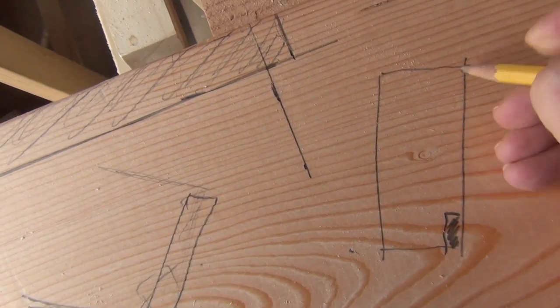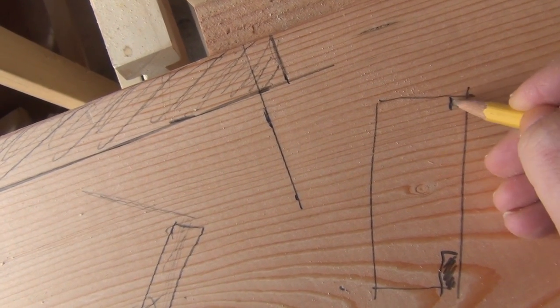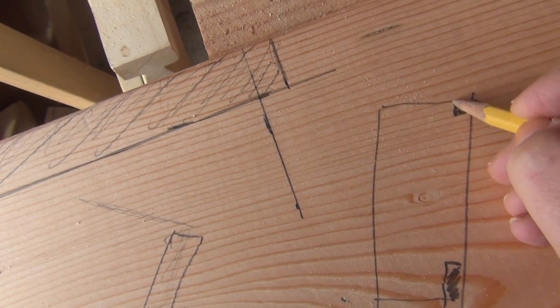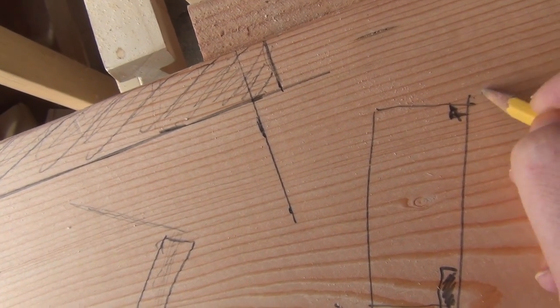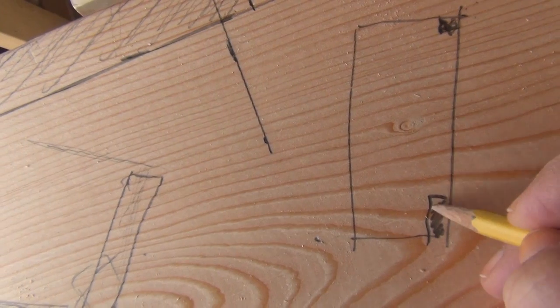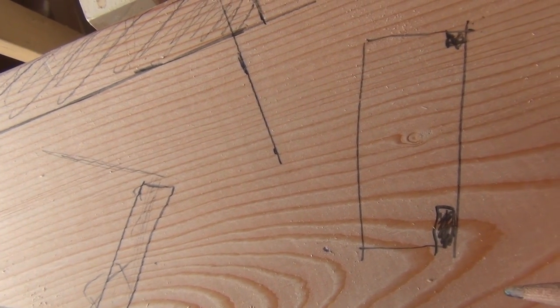On the other end, after I'm done with my 8 feet, I'm going to have this notched. Right here, I got to notch it by about 1 and 2 inches because I have the old crown molding that's on the wall. I am not ripping that one either. So this is notched here and this is notched here. I hope I'm making sense.